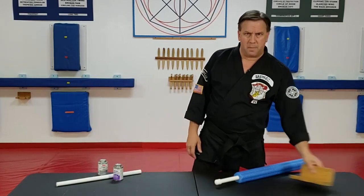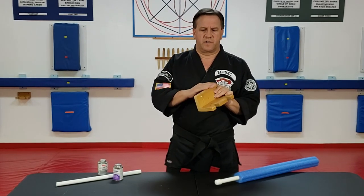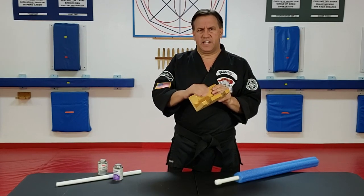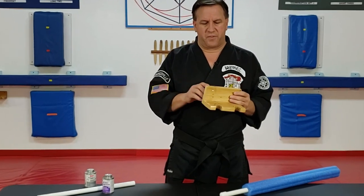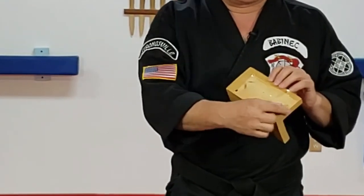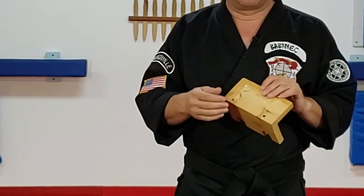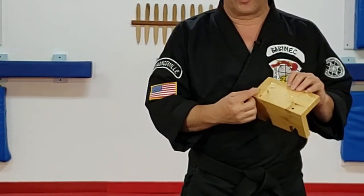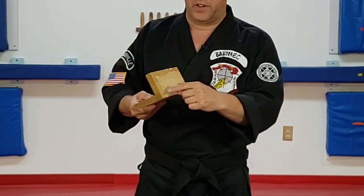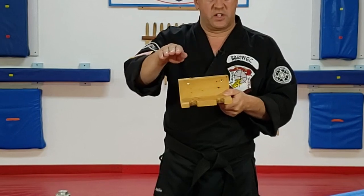Now what I did to hold them up — I also have a holder that we made. This is just one-by-four wood, nothing fancy. We sand down the edges — just any old one-by-four wood. We countersink the back. This is six and three-quarter inches across here — I'll have the specs and a picture for you. Then you just countersink a couple of holes here and here so you can drill into the wall.